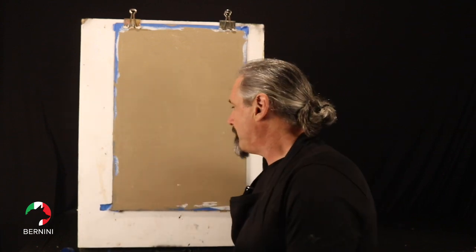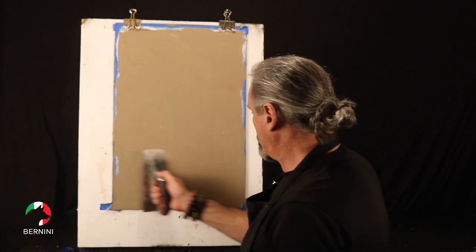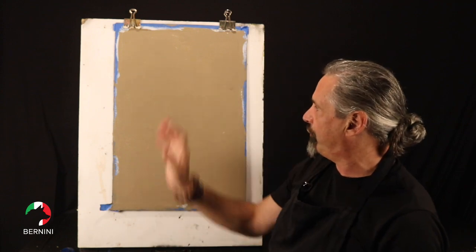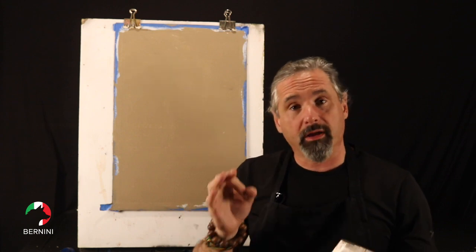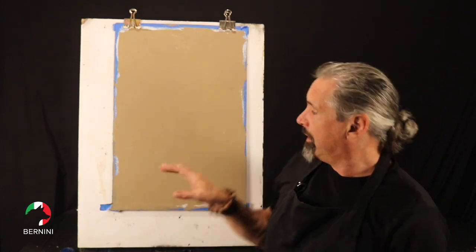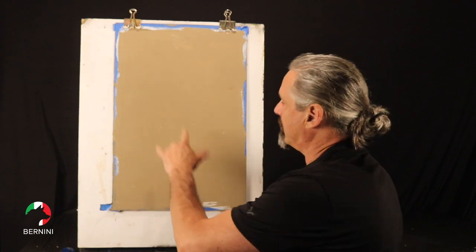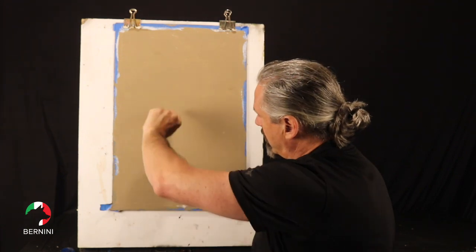Building a plaster or completing a plaster finish is like building a house — this is our foundation. So if we have a lot of sloppiness, irregularities, texture, things that become busy, that will make our finish busy. It will actually telegraph through because when we do each layer after this, everything that we've created here — this movement — will start to telegraph through.